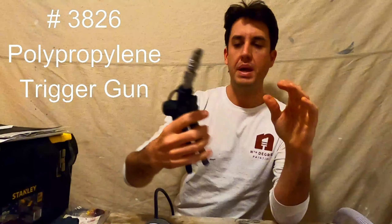50 feet of hose comes up all the way over here to the outlet valve. As you can see, this goes on a barbed end. This is the exact piece threaded into the pump housing. There is Teflon tape inside that connection. I do not overcrank this at all — because if you break this housing, you're SOL. I guess you could do a straight fitting here, but I knew this setup was always going to be on a table and I just wanted to shoot it off the end. Whenever you buy a small plastic part that costs 70-something cents, buy five of them because they will break and you will lose them — why be on a job site without redundancies when they're that cheap?